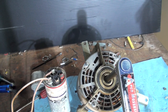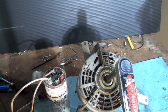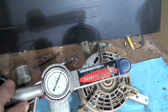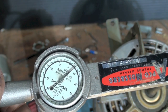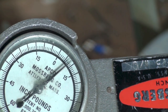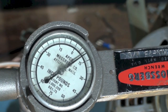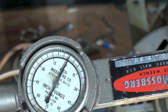Let's try another little trick — let's put a bigger cap on it and play a couple games with different caps. I've got a 5 microfarad cap on this one, which should run about the same as the other. Let's see if we get about the same torque with this Amrad cap — looks like it's just a little bit higher, pretty close to the same, about eight inch-pounds. Now at 7.5 microfarads, the starting torque went up some — up to about 10 inch-pounds.